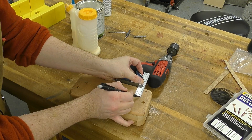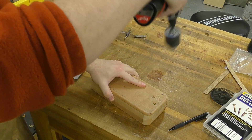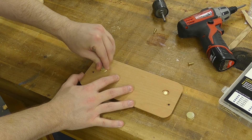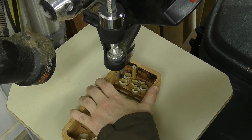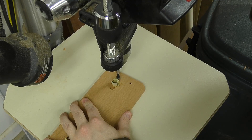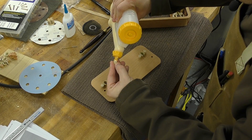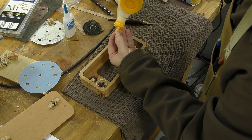The left and right shoulder buttons have been moved to the back, installed the same way as the others with the 5/8-inch holders and 3/8-inch buttons. I also needed to drill out some dowel rods one last time to hold the electronics — on each side of the button holders, I put some 3/8-inch dowel rods into place to give me something to mount the electronics to.